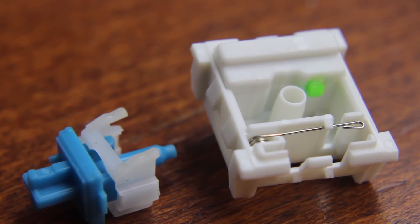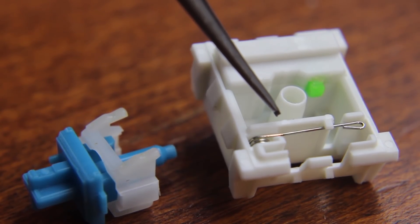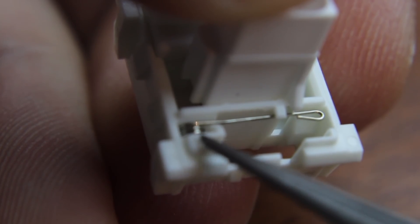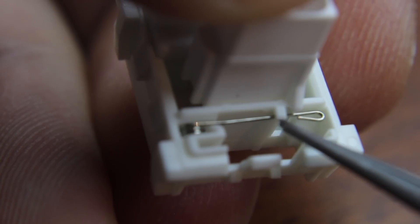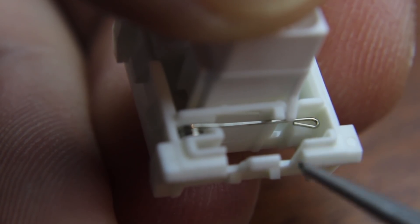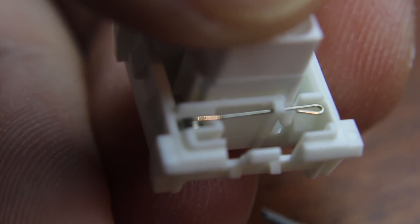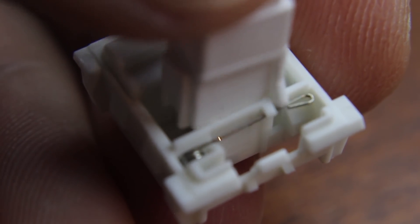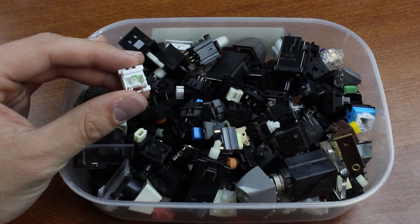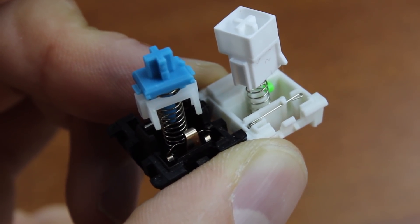The most interesting thing, however, is the redesigned clicker. Unlike Cherry MX Blue, which uses a click jacket with a tiny notch in it to generate tactility, these switches — like the otherwise more MX-like bronze switches — use a click bar instead. This bar is tensed into a coil on one side and held in place by a retainer on the other side, and a wedge on the slider pushes it down as you press the key. At some point it slips past and hits the bar retainer, creating a clicky noise and tactility. This mechanism is unique as far as I know — I own hundreds of different switch types and I've never seen a clicker like this before.